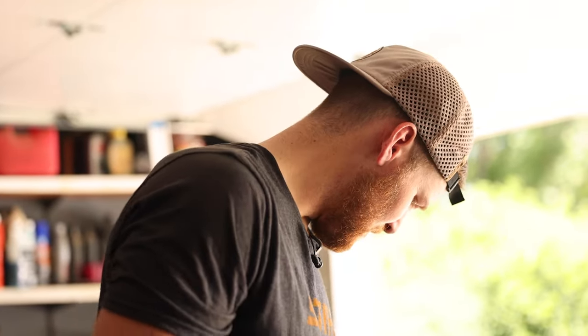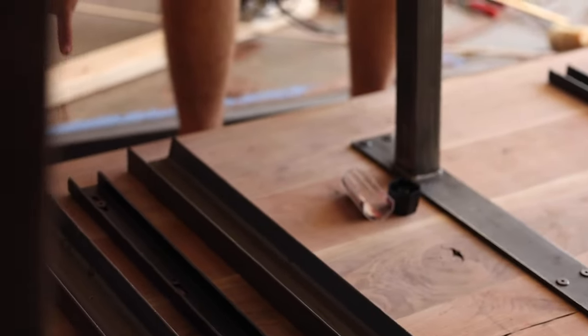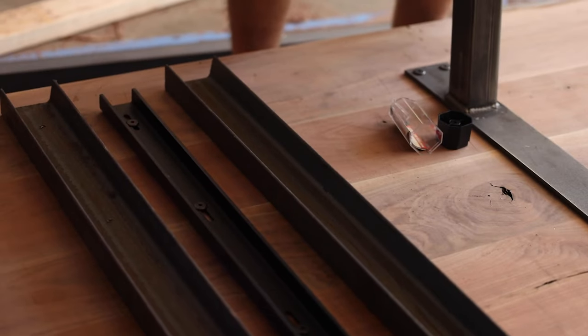So I've got a flat table and I'm going to inlay the C-channels. I had them upside down because I didn't want to inlay them if that wasn't their final spot. Now that I know they're good to go, I'm going to inlay them with my router. Basically I'm going to cut spacers from a two-by-four so that when I run the router along that edge it makes a perfect quarter-inch cut, and the C-channel will just sit right down in it. I'm essentially making notches for the legs of the C-channel to sit right into the table.